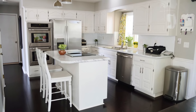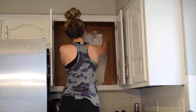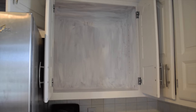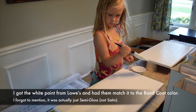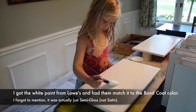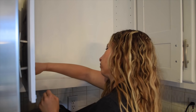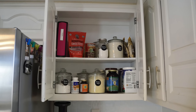I am so happy with the results — I love the white look. I think it makes the kitchen feel bigger and more open instead of small and dark. I did decide to paint the inside of my cabinets this time around; it was more time-consuming and took lots of coats. Instead of using the paint from the kit, I used a white satin finish paint for the inside and the shelves. I also put contact paper down on the cabinet shelves and inside the cabinet bottom for more protection. Here's what it looked like when done — it made it feel like a full update.